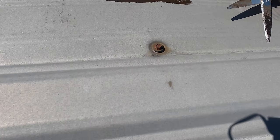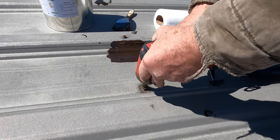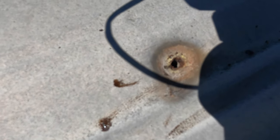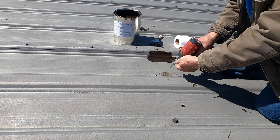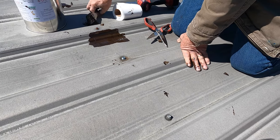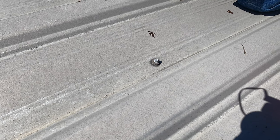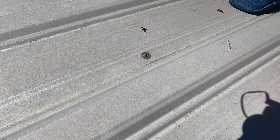It's broken right there next to the roof. There's rust there next to the screw. If you can see there's rust right next to the screw there. I'm going to put a dab of turbo poly seal around this. This screw is not even in — I'm going to replace it with a new one. Always use a bigger screw.